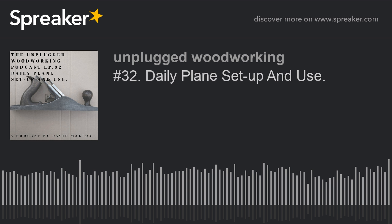You've somehow shifted it. It's probably been something to do with the grain, and I'm kind of guessing here, and in my experience, if you pass over a really hard knot, or you've got some gnarly grain, the grain will grab the blade and pull the blade, if this is making sense, and it will twist the blade. So if the blade's twisted, obviously one side's going to be protruding more than the other side, so you're going to be taking off more on one side than you are off the other side, and that's what gives you the bevel.